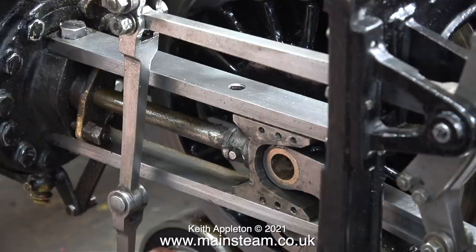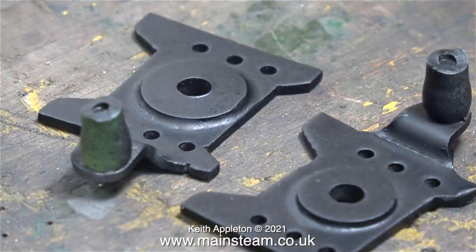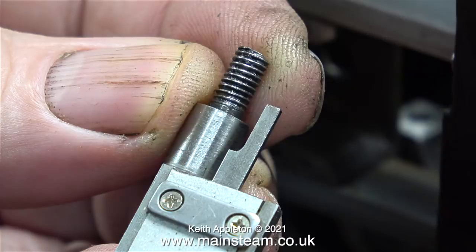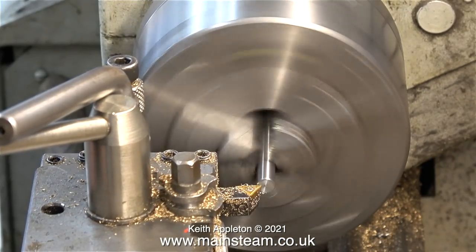This is how it goes together: first you place the connecting rod into the crosshead — this is one of the old pins just to show how it fits, and I'll be making a new one — which in turn will be fitted to the two front plates attached to the crosshead. I'm going to check a couple of measurements because I don't think the old pins were exactly right; they were a bit shorter, so I'm going to make mine a little bit longer.